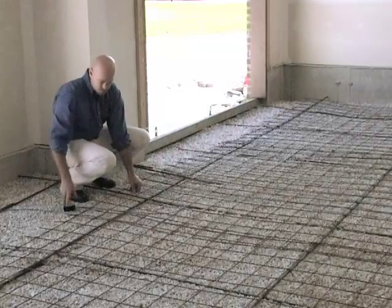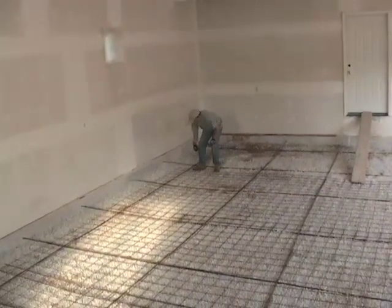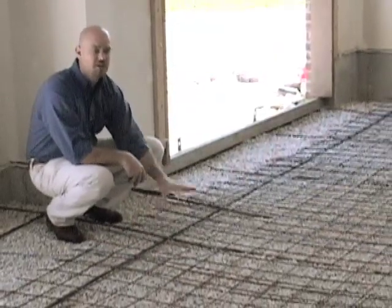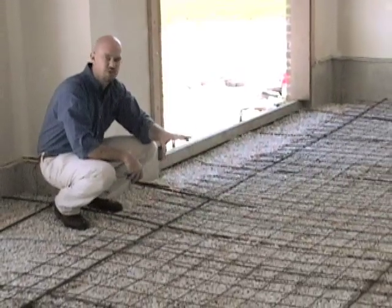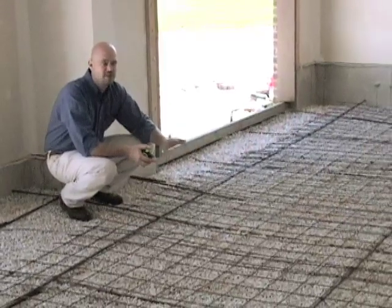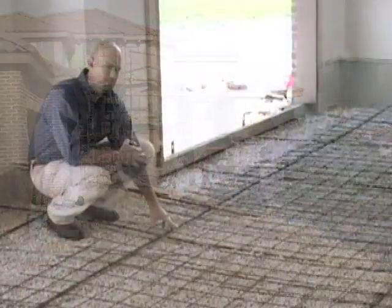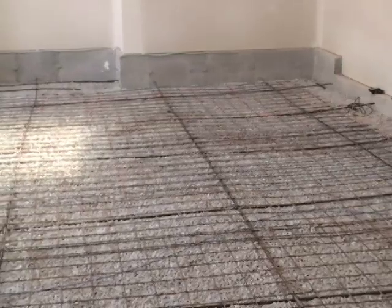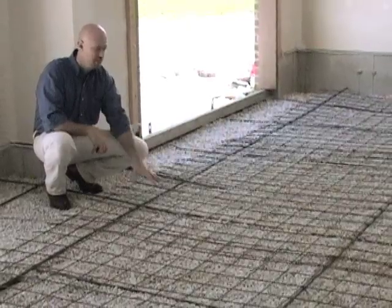In this particular application, we're installing the wire at six inches on center. That spacing matches the exact grid spacing, so we're able to run the cable straight up the grid. This is a garage without insulation underneath, and we're not necessarily heating the room to 70 degrees — 60 degrees is really what they're after, just to add comfort getting in and out of the car. For interior spaces like a kitchen or bedroom, we may need tighter spacing due to heat loss, and those applications would typically include insulation under the slab. The application and design profile will dictate insulation needs and cable spacing.